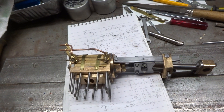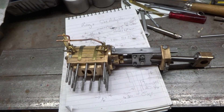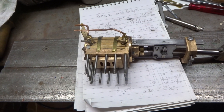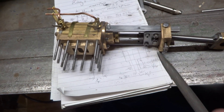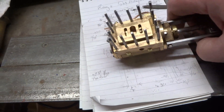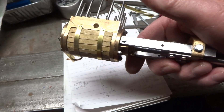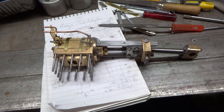This is the underside view of the right-hand cylinder for the paddle steamer engine. Obviously not fitted to its frames or anything, but this arrangement now is pretty much complete. I've fitted the drain cocks and some pipework — not very neat, but it does work. I've sorted out where there was a bit of friction on the piston, and that now moves quite freely. So, come the day, this can go on the engine — that's about done now.